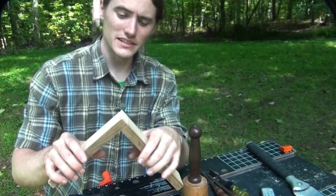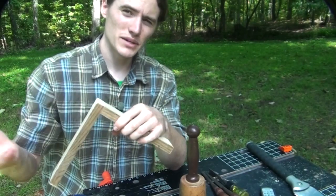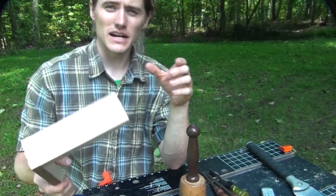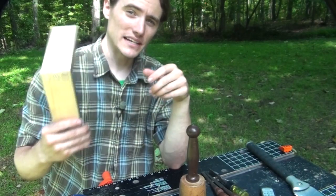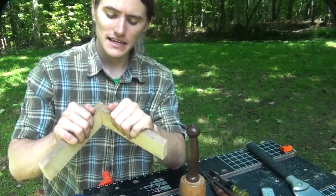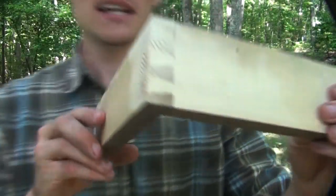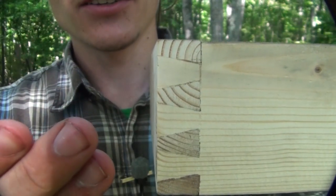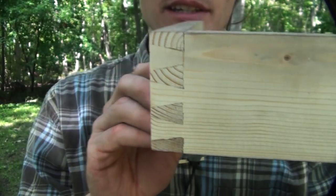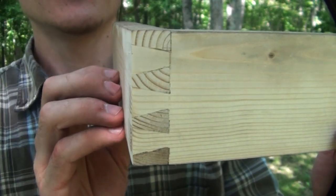As long as you don't get too sentimental about the joint, all you've got to do is go to a chop saw, cut those pins off, and go again. You just go until your board gets too short and pick up some more. To glue up, just brush a little glue in there, slide them together, and then square it up on the inside with a square. The joint has been glued up and sanded smooth — there are the three dovetails and the pin side of the board. It came out pretty good for making a video and using pine, which is kind of soft and a little more difficult than a harder wood.